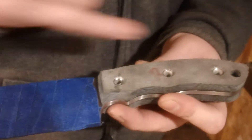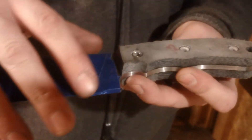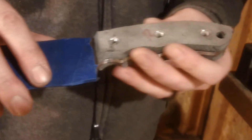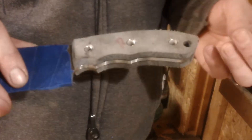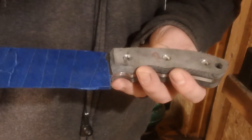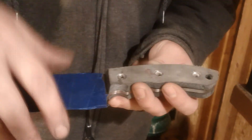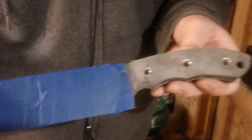I do still epoxy it. The cool thing is, if you have an issue and it doesn't flare, or it cracks, or you don't like the looks of it — maybe it's too shallow — you can drill this out with a quarter-inch bit. You do need to make sure it is right in the center, but it does work. You just hammer the pin back in there and then fasten it. I appreciate you guys watching my video. Have a good day.